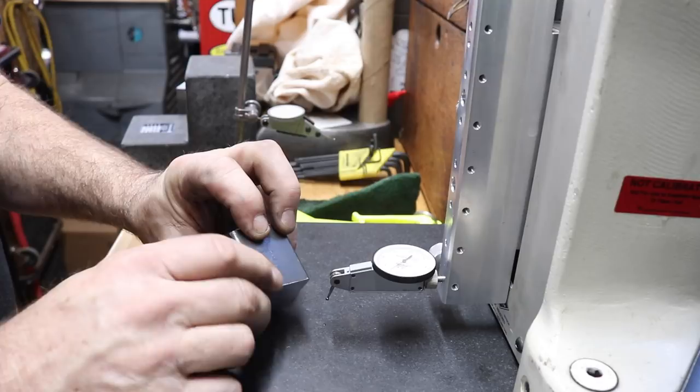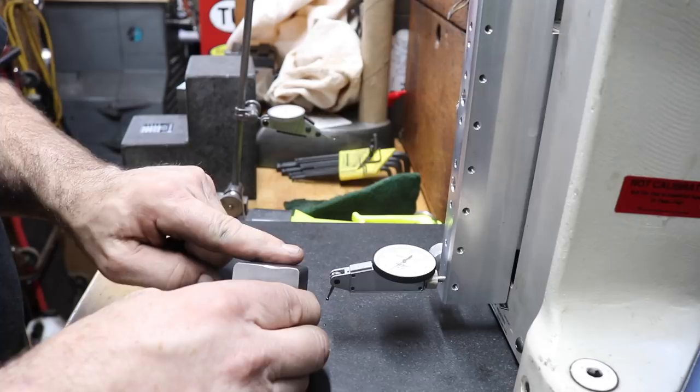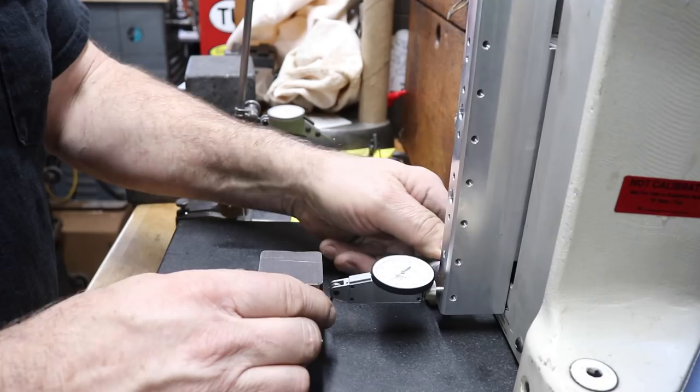These sides are hot rolled, and they're all high in the middle, actually, when you measure them. I need one good side and one good bottom. The top is really incidental. We're going to mill away a large portion of this, and then mill most of this side. So that's why I needed one good side to measure from, and a bottom. So we're real good, and I use my square master here to check squareness of my part when I set it up.